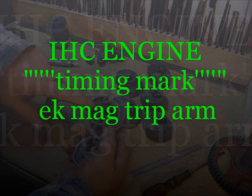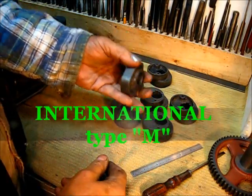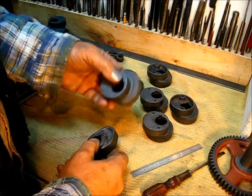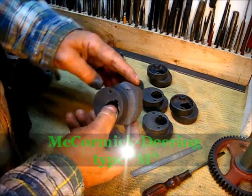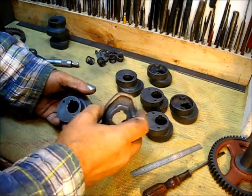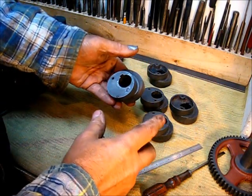The difference is these right here will be found on the very early models — the ones that don't have as much material in there. This one here is an understrike cam, and it actually does the same thing as this one does, except it does it on the same plane. This one is the exhaust cam and this one is the ignition cam. On this understrike cam they did all of that, and if you look at it, you can see it's on two planes.